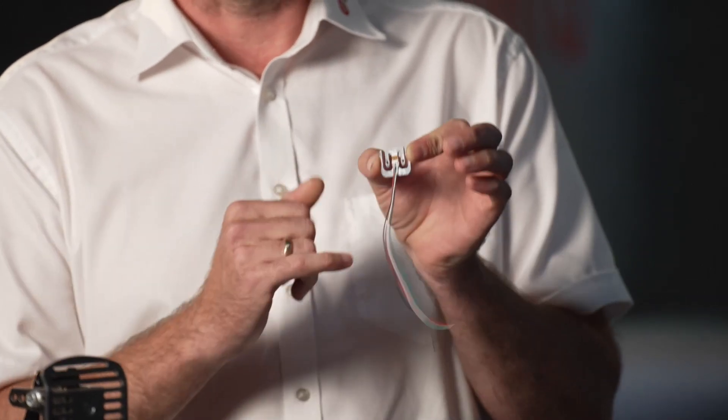This one happens to be from our Forte pedals. The claim goes that we are depending on physical movement, because otherwise it will not sense anything. That is actually correct, and the reason is that this little brown thing with the wires coming out is actually a strain gauge.